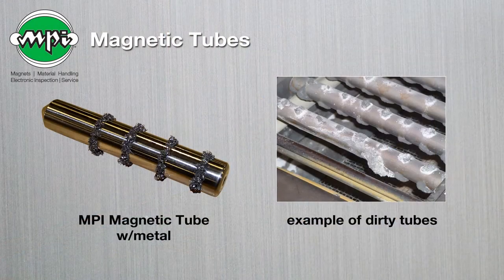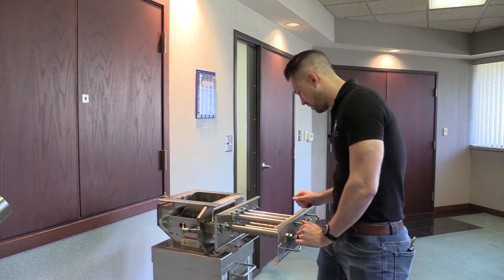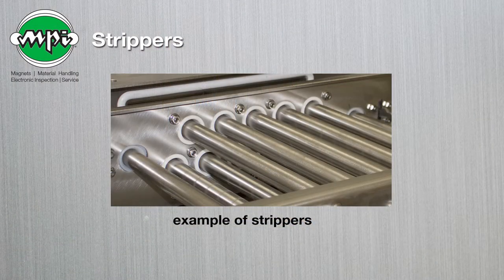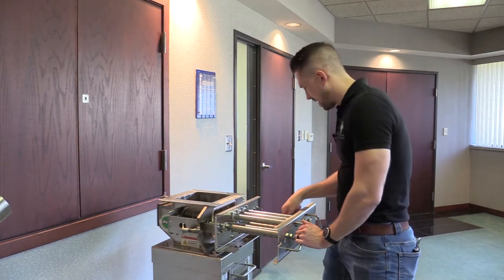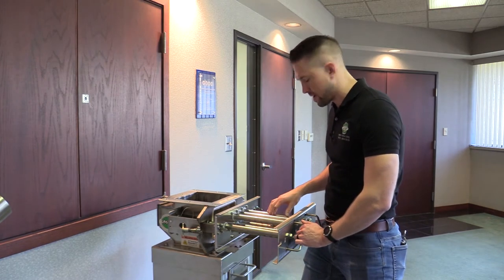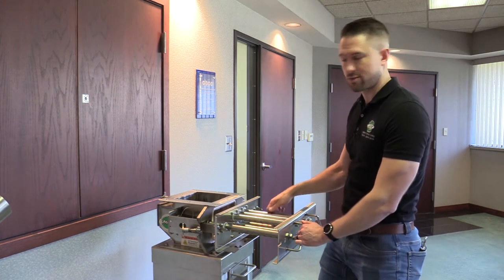I'm going to check the tubes themselves to make sure that they're getting stripped clean of all the tramp metal. If there's some little residual metal — very fine pieces like dust — that's fine, but for anything more than that we would recommend replacing these strippers, which are a typical maintenance item. I'm also going to feel the tubes for any damage and wear. If I'm starting to feel the pull pieces inside, that might tell me the tubes are wearing and may need to be replaced. If you're running an abrasive application, that's something you want to check for, in which case your tubes can be replaced individually as required.